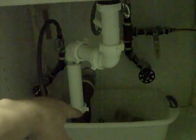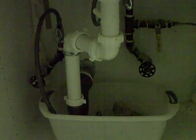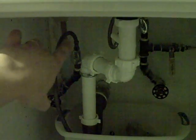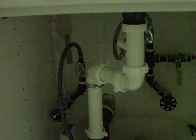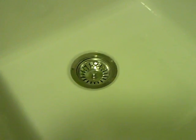I'm kind of proud of my job plumbing the sink drain. I had to take this leg down and bring it over so that it would line up with the P-trap that was already in existence. I've only got the cold water hooked up — I've still got to split the water on this side and the hot water for the dishwasher, and then I've got the tap up here in the back for the dishwasher drain. But so far no leaks. I ran water in there, filled up the sink and let that drain out, and that didn't back up or run over. So far so good.